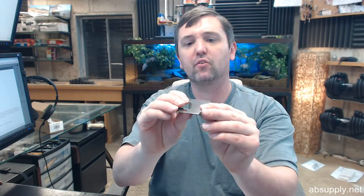There is a link below this video to a document called Template, which is very handy because it shows you the important dimensional properties of this item. You can see all of the information that I have not provided dimensionally. Okay. It does refer to the fact that it's 18 gauge or 50/1000ths of an inch thick, which is typical and common for a strike. Same thickness as a commercial kick plate, if that's any point of reference for you.